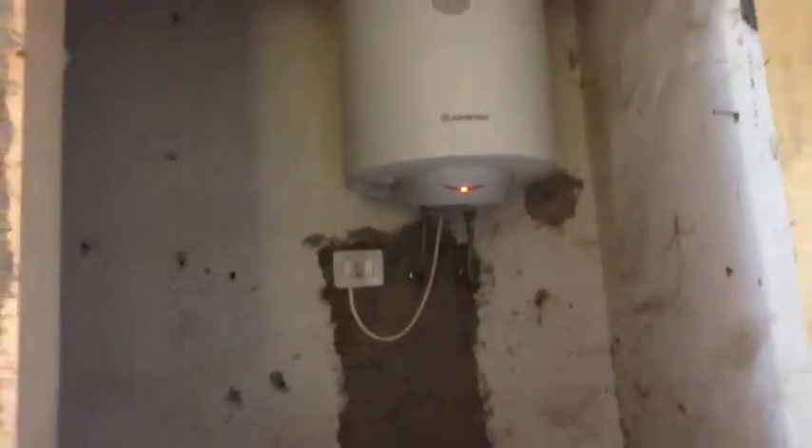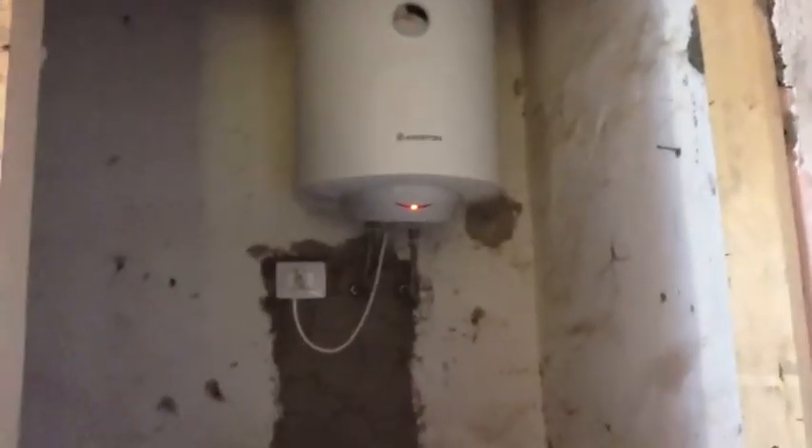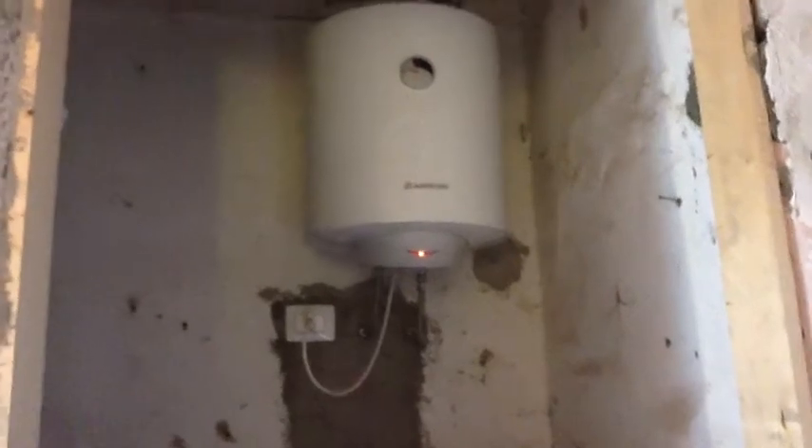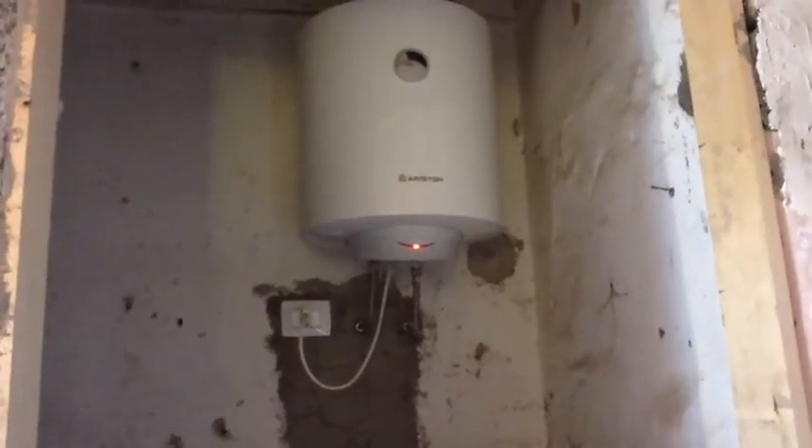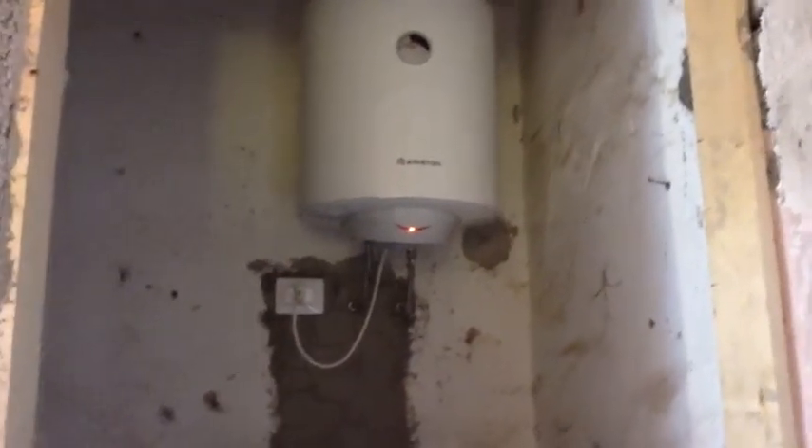In here you have your hot water boiler. To get hot water you need to plug it in here, but you must always remember that you need to have water in the system, otherwise you will burn the boiler. I'd also disconnect that when you're turning the water off, so that if pressure drops in the plumbing it won't burn the element.